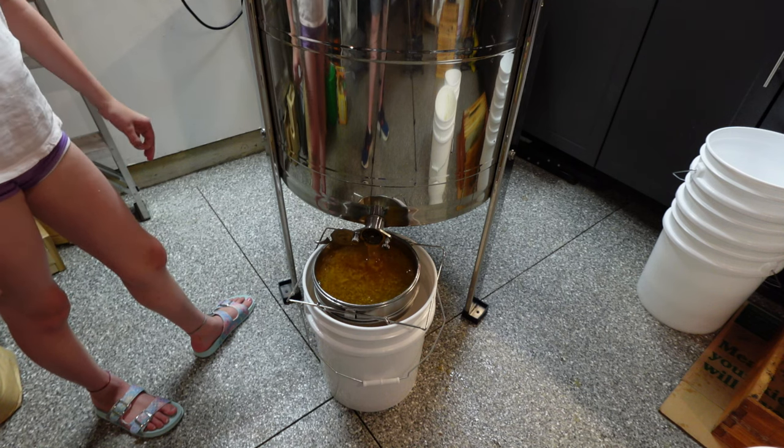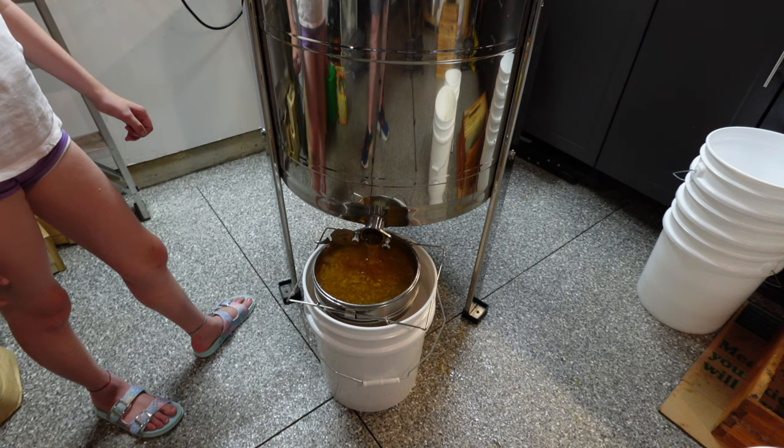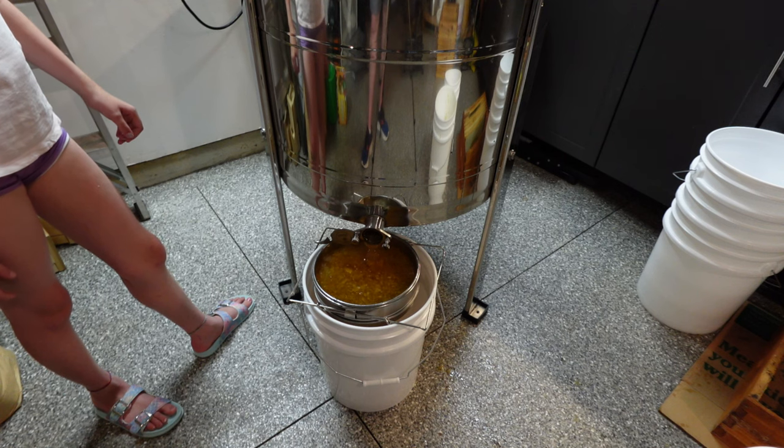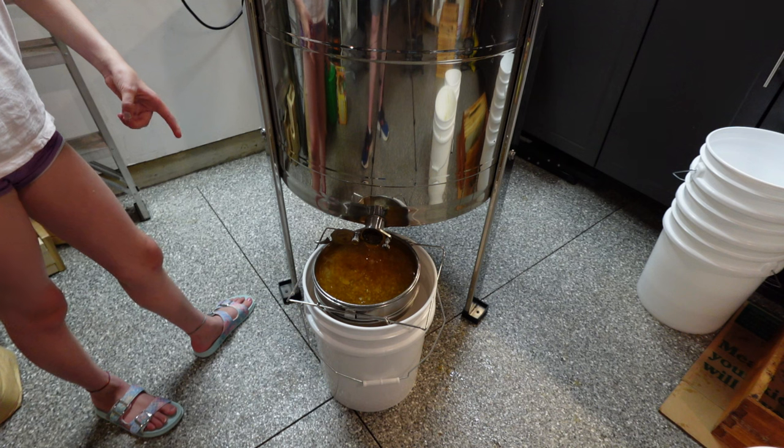Eventually we may have to either close the gate and slow it down for a minute to let the filter catch up — we don't want it overflowing. It's not the end of the world since we can always re-filter the honey, but just the difference is incredible. We'll be able to do 18 frames all at once like this in just minutes versus multiple days.